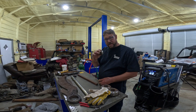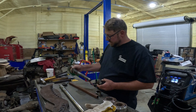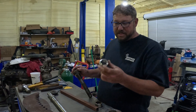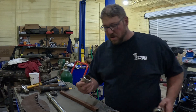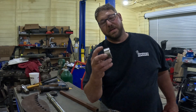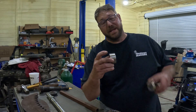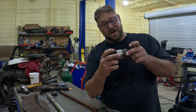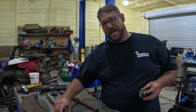This part came off the old pin and it was to center one side of the bucket. I cut this part in half and then I took an old socket — this is an old three-quarter socket — and I turned it down to the outside of the bucket diameter. I turned down the outside of this to the inside of the bucket diameter. I'm going to weld these two together so that this will center my inch and three-eighths pin.